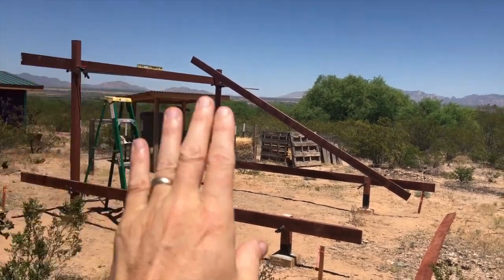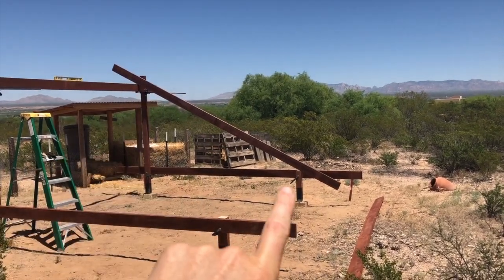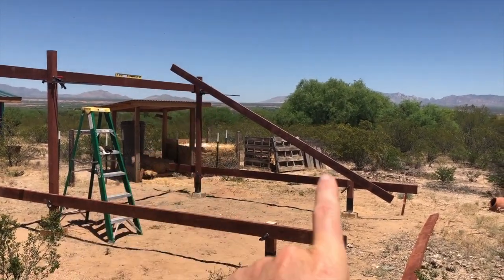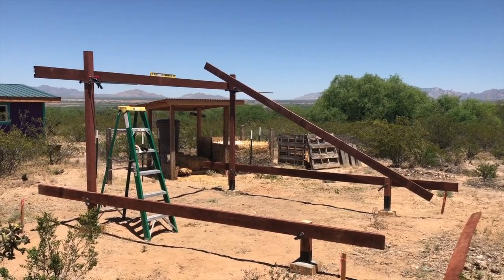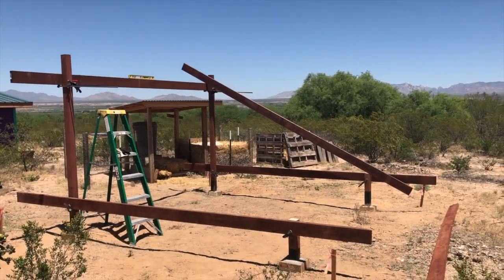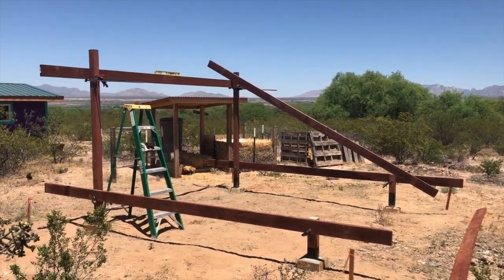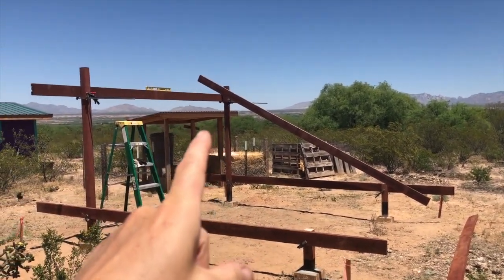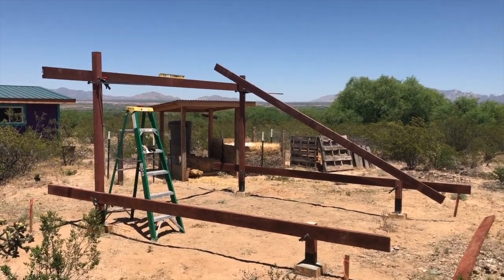Everything works out — all the distances, I'm all square, I'm all pointing south. Not only do I get 27 degrees, but the span of that beam is exactly what I want it to be — within a quarter of an inch of the actual geometry on paper. The length of the hypotenuse of that triangle comes out to what it should. I won't bore everybody with the math, even though I find it really interesting. That tells me I've got all my posts in the right place. So I can start the next step: putting my front beam and back beam and then putting those rafters — I'm going to notch them with a little bird's mouth cut like I did on the roof of the shed.